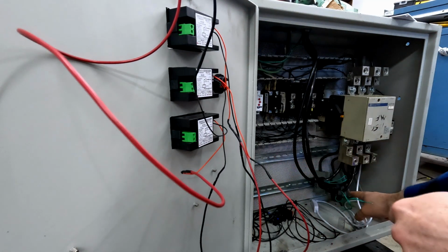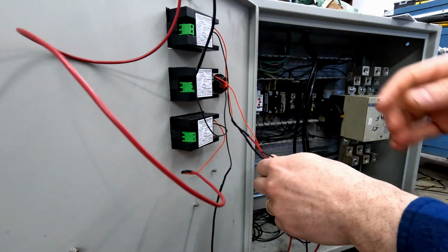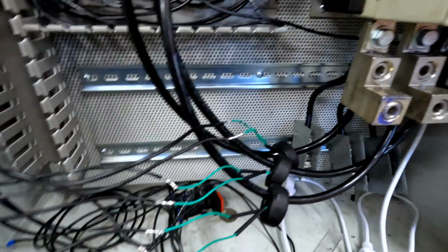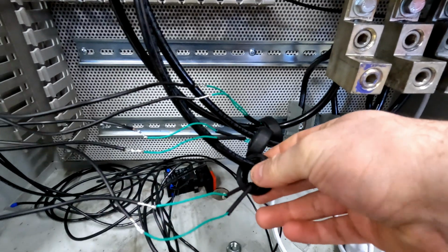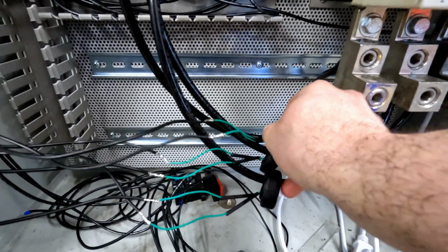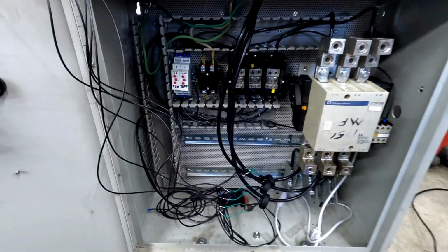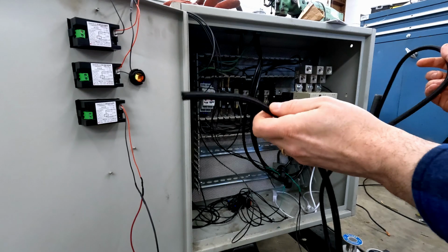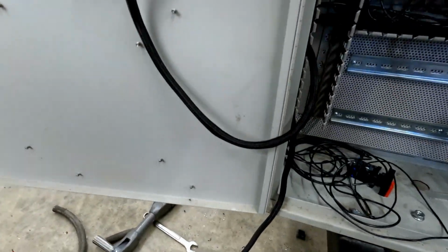Next, I'll route these all the way to the terminals that connect my balance capacitors. But first, I'll get the current transducer soldered in place as well. Here are some of those nice, neat solder connections for the current transducers. Get them heat shrunk on, and then tie these looms together. With all of the wires for the panel meter soldered, we can go ahead and get it in some wire sheathing. I've got all the connections made.